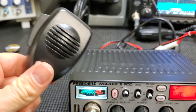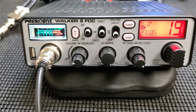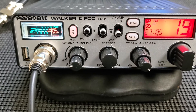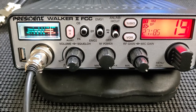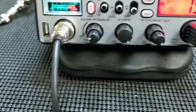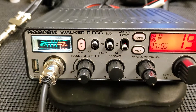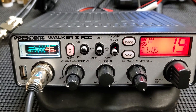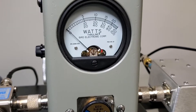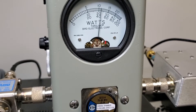I've got the mic — six pin on this one, with up and down present. You can go into the service menu and adjust the AM modulation a little bit if you want. Let me make sure the mic gain is actually up all the way. Check, one two one two, check check — yep it was. Let's see what it's going to do — this is the over the air audio right here.